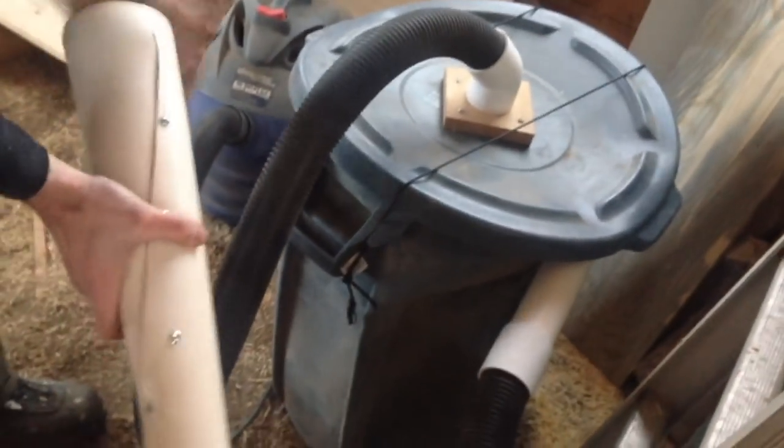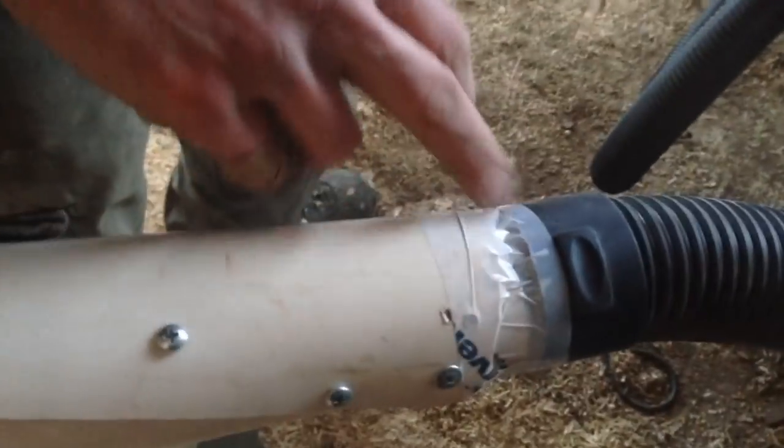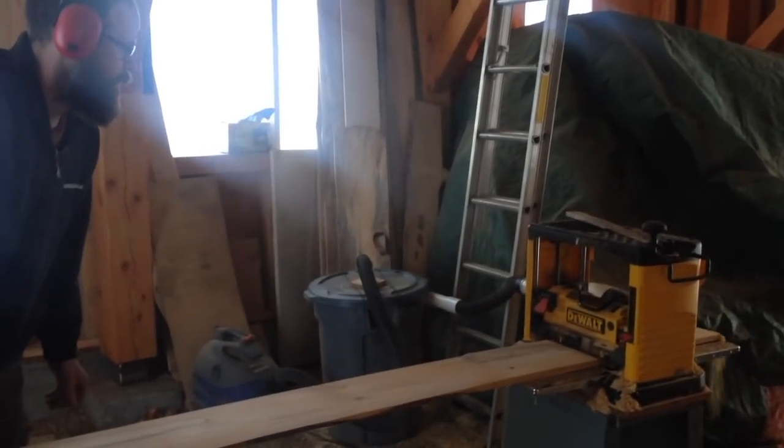When you're checking to see if your system is airtight enough, turn on your vacuum — a plastic can like this should be able to make it crumple if you plug it up. That's how I found the air leak in the cone: I plugged it up, looked for the hissing air, and that's where it was, so I put some tape on it. That's my little cyclone dust collector, and it's saving me a bunch of time. Yesterday I made all of those bags of sawdust.